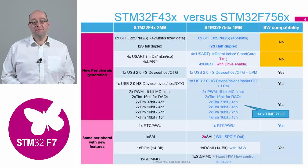I2C, SPI, and USART — we've made some enhancements to the peripherals of those three comms channels, so therefore you don't have 100% software compatibility anymore. You will have to check what the enhancement is and make sure the registers are being configured correctly. There might be extra commands that have been added to cover some of the newer features. So you can't just recycle the software 100% for those peripherals — you will need to check. If you don't need those new peripherals and your register configurations aren't changing, then your software will work, but you do need to check it.